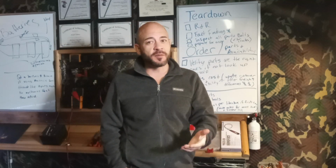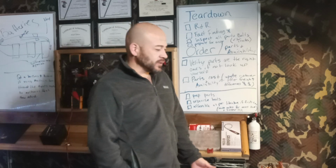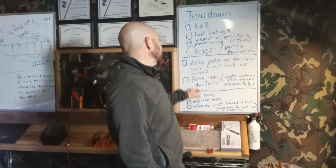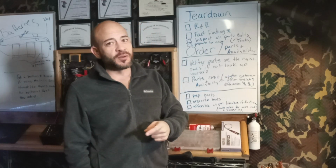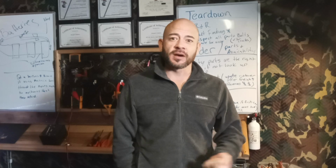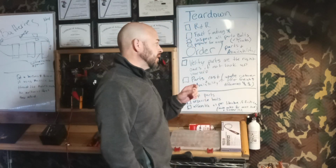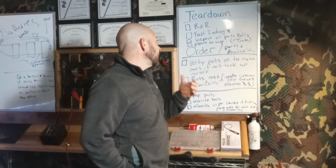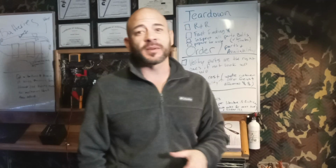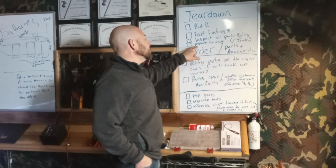And look, if you're using head bolts, which we know you can measure some of them and some specs are different than others. Use new, use old, whatever. Follow the manufacturer spec. But you want to make sure you're not installing a bolt, say an injector hold down, that when you go to torque it, it's going to break off flush because the filler is already starting to stretch beyond where it should and there's a hairline fracture. I did this. I do this. I know it takes more time, guys, but do this in the beginning. Trust me, do it in the beginning, and that'll save you trouble later on.